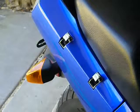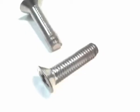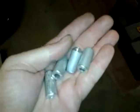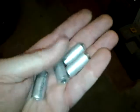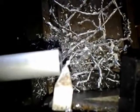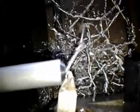The rack will mount to the bike using the cargo hook bolts on the side. The original bolts have beveled heads. Since I want to have a gap between the sidearms and the bike, I need to make some spacer tubes. These spacer tubes are 1.1 inches long and have a bevel on one end to match the bevel in the cargo hook. One way to make a bevel is to use a grinder. The drill bit sharpening groove is just about the right angle. But since I have a lathe, I'm going to use that. With the lathe, I can also use the parting tool to cut the tube to the exact length.